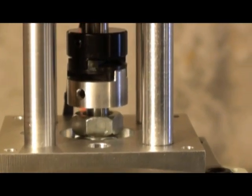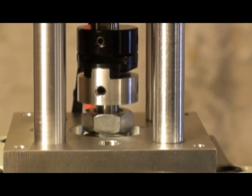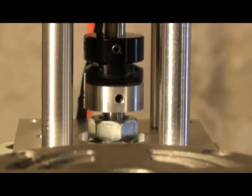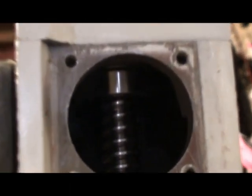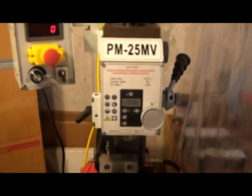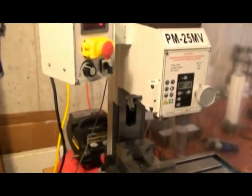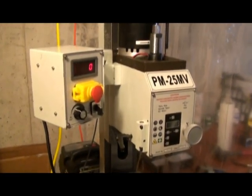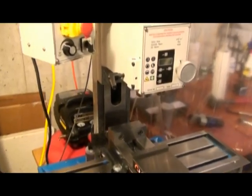I'm picking up about ten thousandths of an inch of wobble on that shaft as it's moving. I can also look inside the little peephole where the Z crank used to be, and if I watch real closely I can see that bearing kind of skating around a little bit inside there. So it looks like that screw wobbles, and as much as I tried to avoid any kind of concentricity errors in it, I don't think I succeeded totally in doing that.